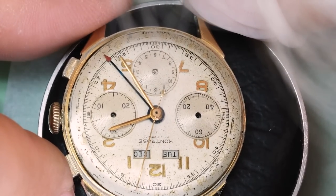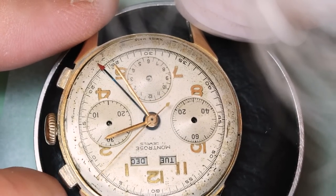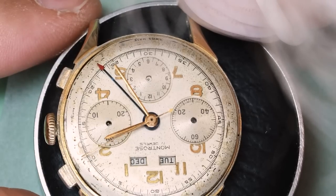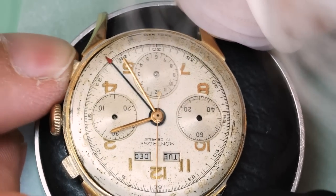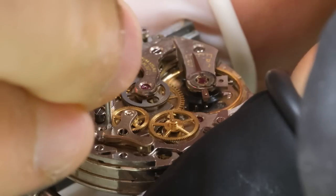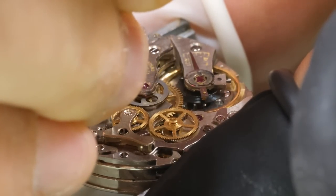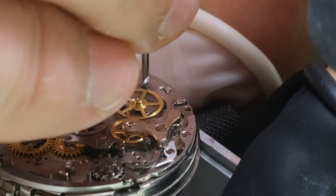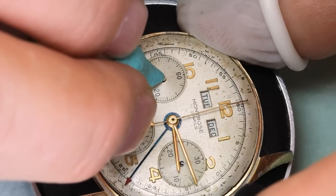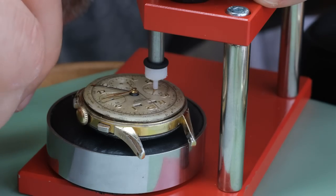Trying it again, we see it does seem to work better now. The seconds hand is misaligned a little bit, so I'm going to take that off and fix it off camera. There's also a stutter in the chronograph seconds hand, which is another problem to fix. The problem with the stutter can either be this friction spring on the underside of the chronograph wheel, or it can be the depthing between a couple of the wheels — so I adjusted both of those, and then we can proceed with the small hands.